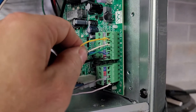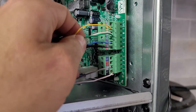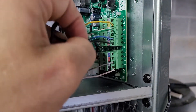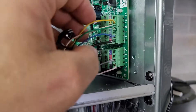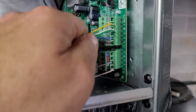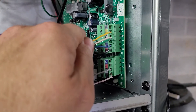So we've got Y for the contactor, W for the heat kit, G for the fan, C for common, and this black wire is actually the R after it's passed through a float switch — so it's changed colors. It is important to remember to set up your thermostat as though it is a one heat, one cool, even though this is a two heat, two cool system.